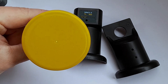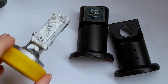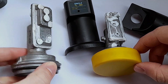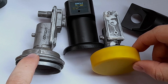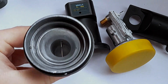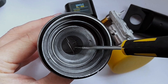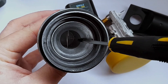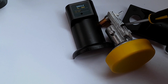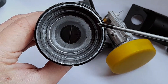We still have the yellow plastic cap on the waveguide input, which I don't believe I can take apart without damaging it. So I've prepared another, older LNB over here - we'll have a look inside this one, since these waveguides are mostly going to be identical; it's just the electronics that have changed over time. Looking inside, we see the two probes: this would be the vertical one and this one the horizontal one, and these are actually going to the PCB. I don't want to damage the cap, so not a lot more to see there.